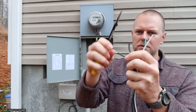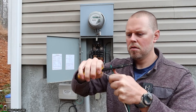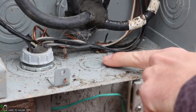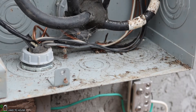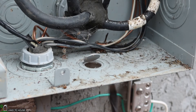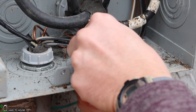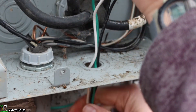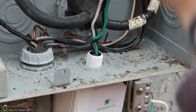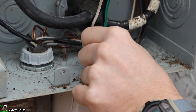I'm going to strip that back down to expose the wire. I need access to a half-inch knockout — I'm going to use this one right here. Just put a screwdriver up under here and pop that free. Now I'm going to feed all four of the wires up through that knockout, slide the locking nut back over, and tighten that down.